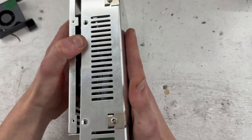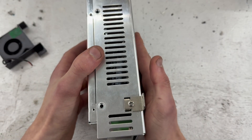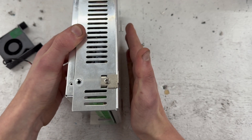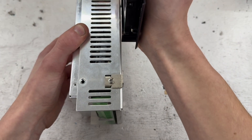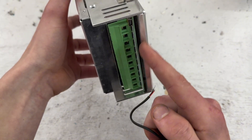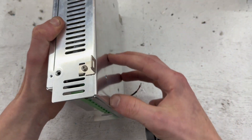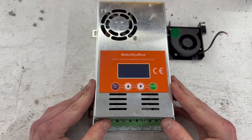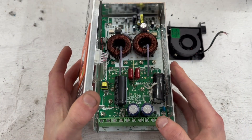What we'll do with this little fan is move the controller one to two centimeters out from the wall, then put this fan either behind the unit or make a hole inside it. There's some space between the board and the MOSFET so the air can blow through and cool the whole plate. That's the plan — I'll test my theory. But first, let's open the unit and see how the MOSFETs are placed.